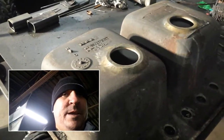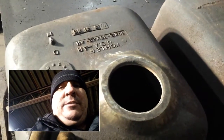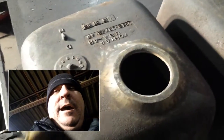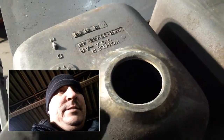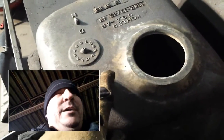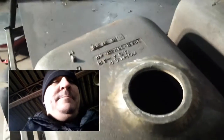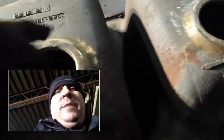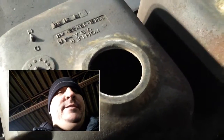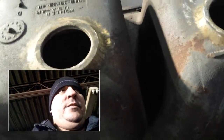What I'm going to have to do is heat up each individual base. I've already done some preheating — it's real cold in my shop, about 30 degrees in here, so I'm really going to have to keep the heat on this thing while I'm working with it. The goal will be to get the cast iron up to about 500 to 600 degrees preheat, weld it, maybe a couple of different spots because it's going to cool down fast, then do a little more preheat and finish welding.